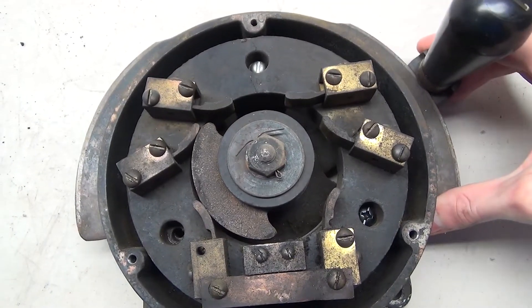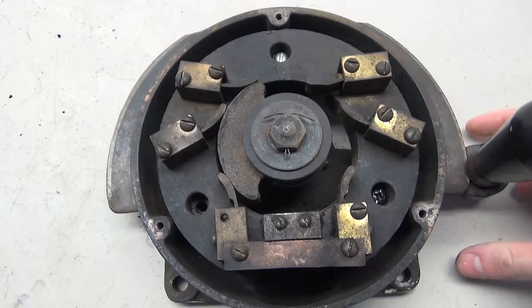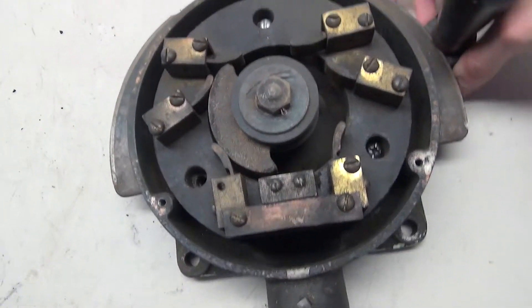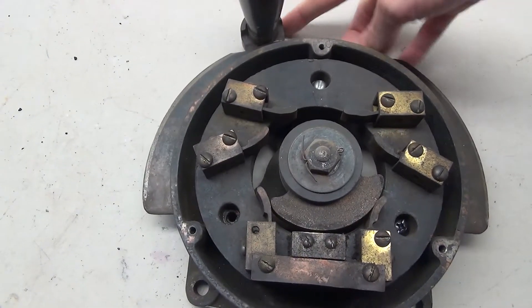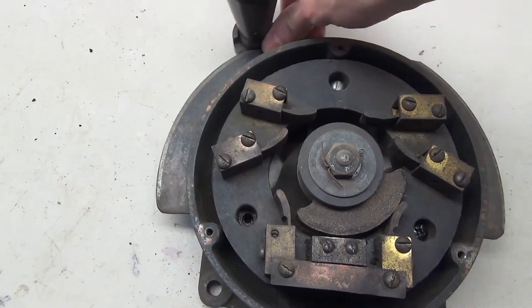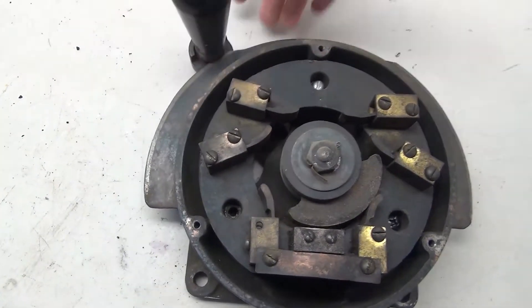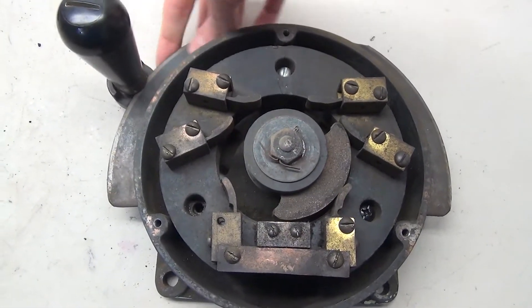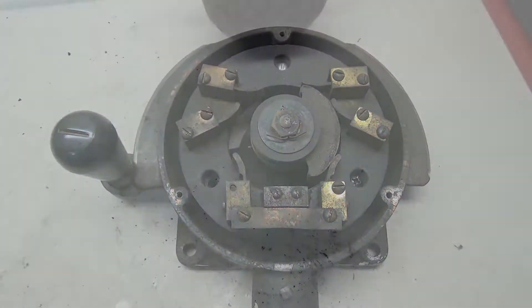You'll notice there is a metal bar on the bottom, and when the handle is turned it pushes against these contacts. Just by looking at how this is, I can tell this is a two-speed controller because there are two contacts on each side — this would be for the other direction. Lift up the handle and then slide it down: you'll see the metal bar connects the first set of contacts, and then all the way down completes the second.